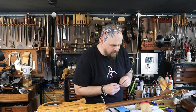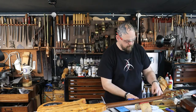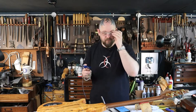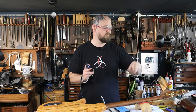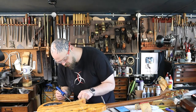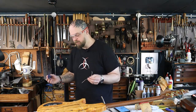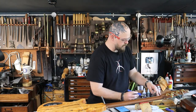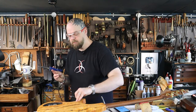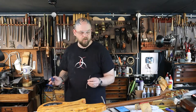What are the chances blue dye will stain a mahogany body? Very, very good. I'm not entirely sure what colour you get, potentially purple. I'm very glad that the microphone button and the kill the stream button are on opposite sides of the deck here. When you're using a stain on a darker wood, the colour of the wood underneath will come through and you don't necessarily know what it's going to look like. A blue dye or a blue stain will look blue on a white maple or something like that, but on mahogany, who knows? It'll be bluish, that's for sure. But run tests. Always, always run tests.